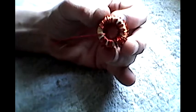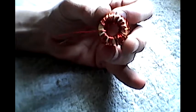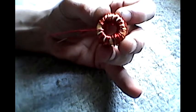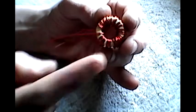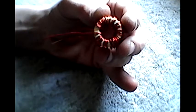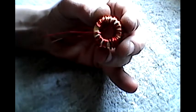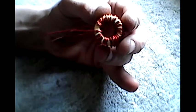And there we have it — a toroidal coil, perfect if you want to make a joule thief. I actually got this ferrite toroid out of a computer power supply. It had far too many coils on it so I uncoiled all the magnet wire so that I could rewind it with exactly the number of coils that I need.